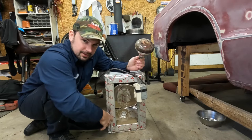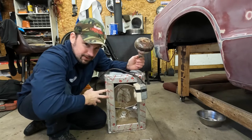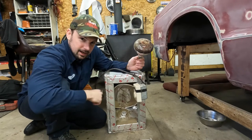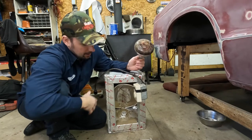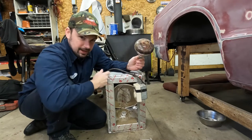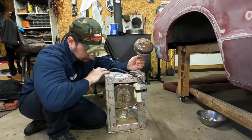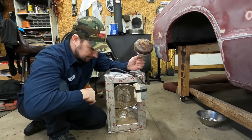The outside has tape over it with about a half inch of foil-faced insulation, to push the heat out into the living space. The doghouse is insulated, but it's just one extra measure to make sure the outside of this box doesn't get too hot against the door entryway.